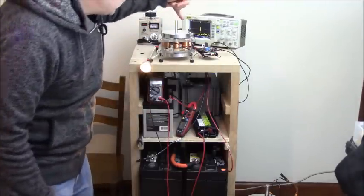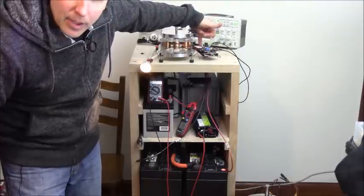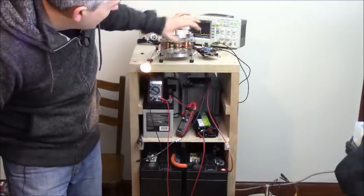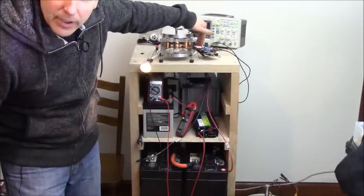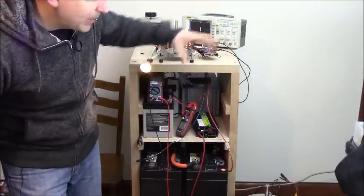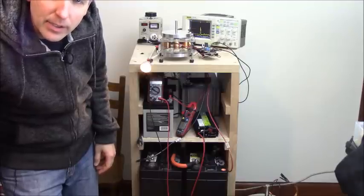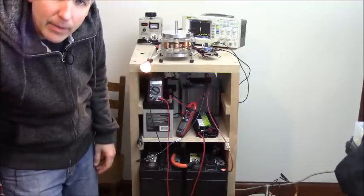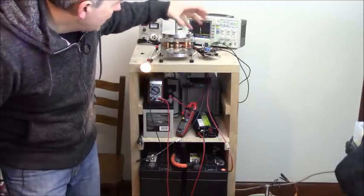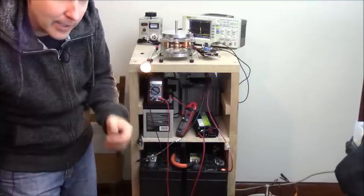The other thing that I'm doing now is I'm going to put no wire length between the coils. Like I have this wire length from here where they all come together, and I'm going to put the board right there from now on. So there's the least amount of inductance between the coils. So I've reduced that wire. Usually I provide a whole 8 more inches of wire length, which I won't provide now.